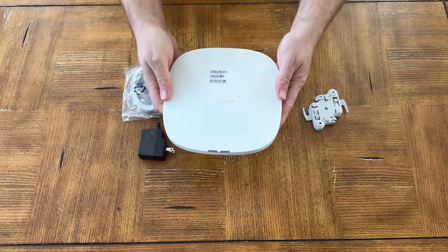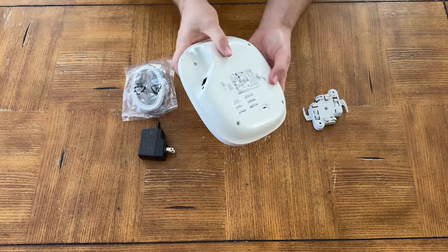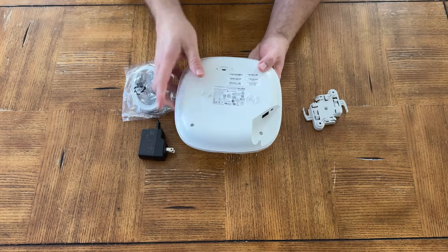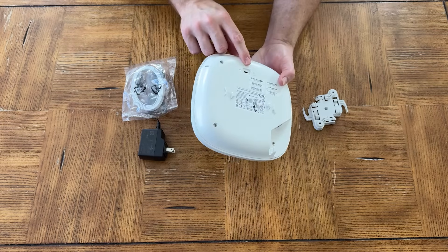Moving up from a mesh system, you get into the world of dedicated WAPs. These are mostly Power over Ethernet (PoE) systems, meaning you need Ethernet run to each location. You mount these units strategically to cover the area you need, and they provide Wi-Fi over an Ethernet backhaul without needing a separate wall wart or power adapter. Everything flows over that Ethernet cable, giving you the ultimate flexibility for providing Wi-Fi access to a facility.